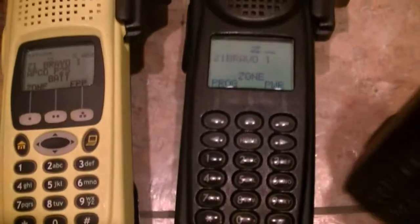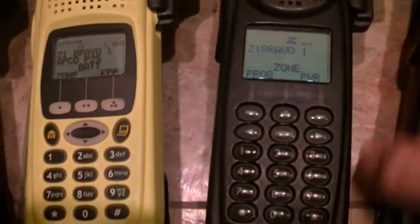You can find out about missing pixels by turning your radio off, turning it on, it's off scan, put it in service mode, hit the top button, and then push the man down, and it'll show you if there's missing pixels. So that's how you check. And it'll also tell you the flash code, the firmware version, serial number.